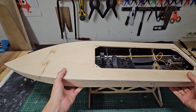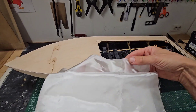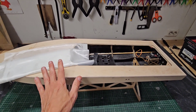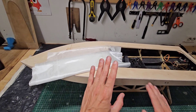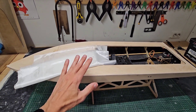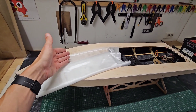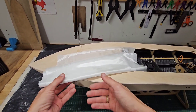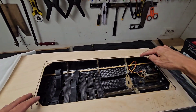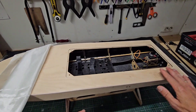In my case I'm going to use 50 grams per square meter of glass — that's a really light weave, and I already cut it to size. This is just because it's what I have laying around. Normally I also have 100 grams per square meter or 200 grams, but I think 200 grams is a little bit too heavy, so I'll just use 50. You can also use 80 grams or 100 grams, no problem. 200 grams is a little on the heavy side, but don't worry if you don't have 50 grams — just use a slightly higher mass, it's no problem. Before applying the weave, I'm going to mask off the hatch opening with the support so I don't epoxy it, and then we're going to apply the weave.